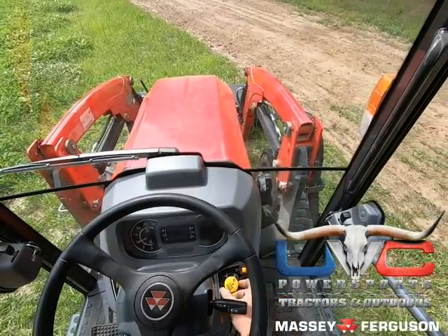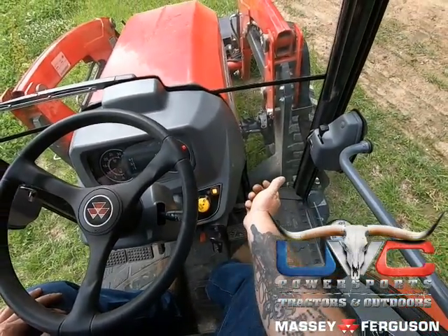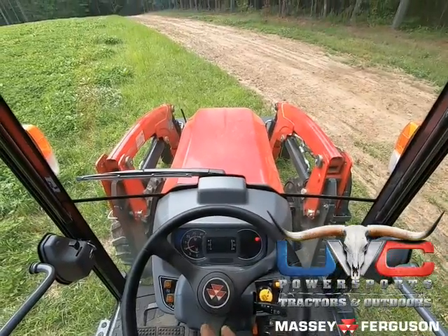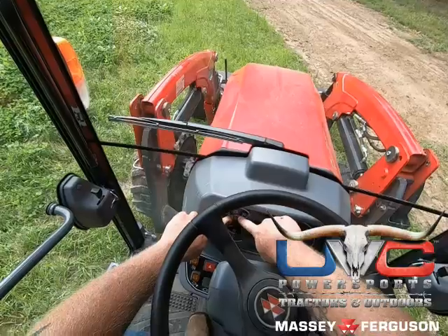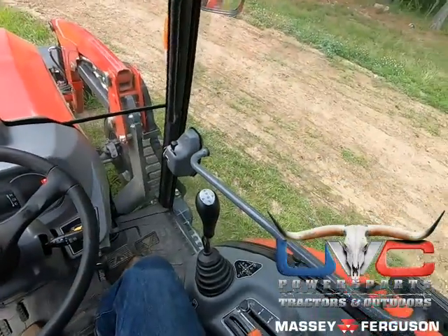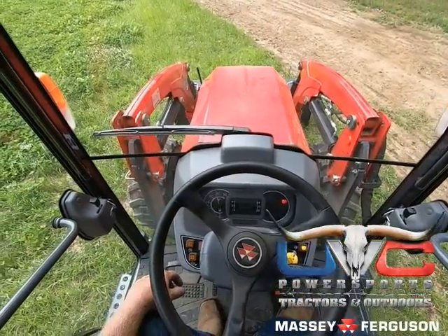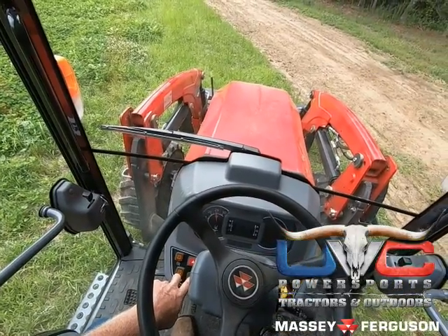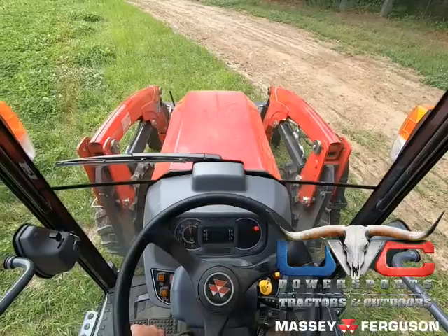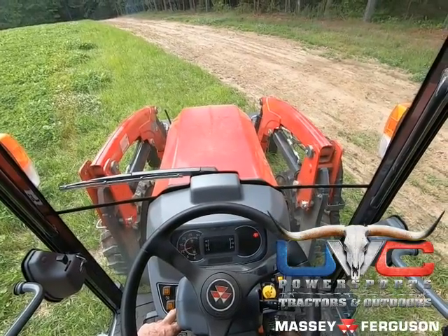While you're running — there you go, three-point is running — you click it once and it's off. You push in, turn, and your PTO is turning. You can see our PTO is running at 540. That 540 is where you want your mowers to be — where they're designed to run at the right RPM, right in between those marks. If I'm mowing with the hydrostatic model, I'm going to turn my idle up to that 540 range. You can change your display to show you exactly what RPM that PTO is turning — 540 RPMs. As you start moving it might drop a little, then you give it a little more fuel and keep it right there.